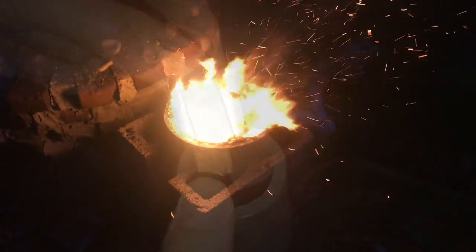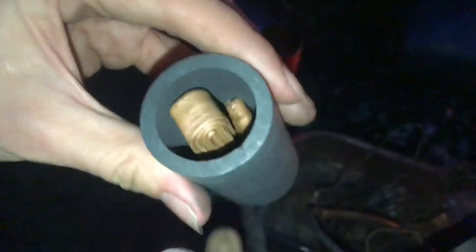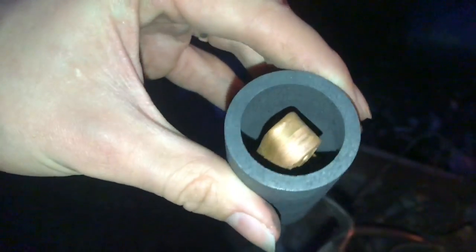It's not enough coal, so here it goes. I'm going to start out with just the copper because the pewter will oxidize away very quickly, so that'll go in at the end. It'll also melt quickly.